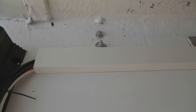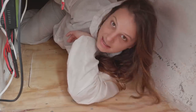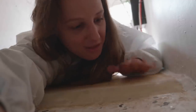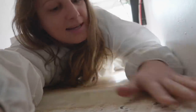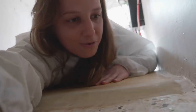We actually already painted the wall on one side a bit earlier so that Troy could install some conduit in there so the wiring runs — solar wiring, autopilot, and deck light — could run back to the stern in a nice, neat, clean finish. I'm here right aft and you can see where our new flooring has gone in — our new really thick piece of marine ply. We've put thickened epoxy in here, some layers of glass, and more thickened epoxy, and I've faired that back with the multi-tool and orbital sander ready for paint.